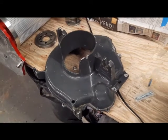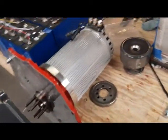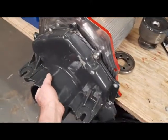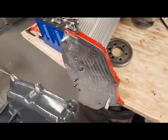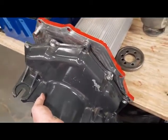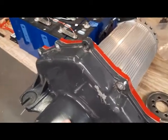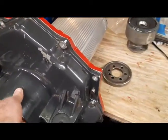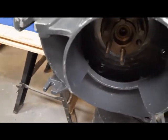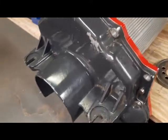This is the bell housing — flywheel housing from the V6 that we took out of the boat. And as you might expect, it fits. I had to drill out the bell housing for 7/16 bolts — that was just a fraction larger. The spline coupling is going to attach onto there, and that will look like the back end of a V6, hopefully.